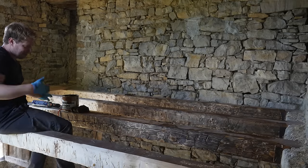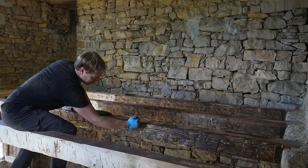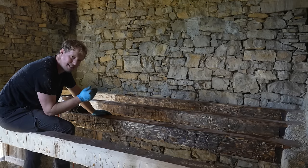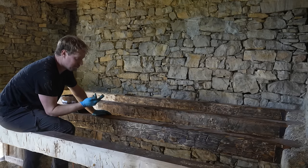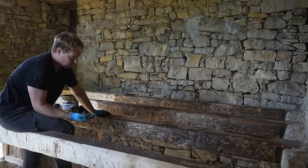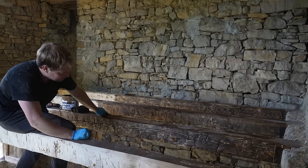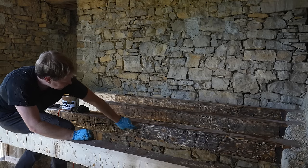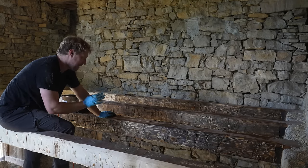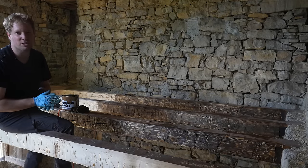The light burning actually lightens the stain a little bit, but then it chars the tips of all of the axe marks. Where there's a fine point, it darkens that ever so lightly, which is removed in the previous burning when I wire brush, because you have to burn first, then wire brush. So all of that contrast is removed. So we're just lightly adding it back, because at least I personally love the contrast between the dark edges and the light wood where the stain can't quite reach when using a rag. But it's all personal preference, but mostly it's just fun.